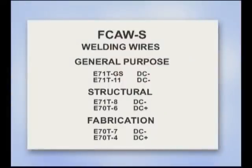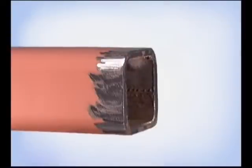Whether you're fabricating with new metal or making repairs, always remember that every weld joint is made one weld bead at a time. Understand the characteristics of the specific welding wire you're using. Take the time to get the metal ready to weld. Set the voltage and wire speed high enough to allow the puddle to spread out, tuned together for a short arc length. Watch the edges of the puddle and the weld build up, then travel at a speed that maintains a uniform weld puddle. Maintain the recommended wire extension using the gun angle and travel speed to control the amount of filler metal deposit and the shape of the weld bead.